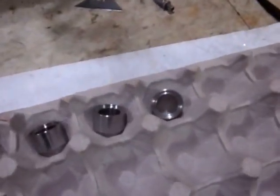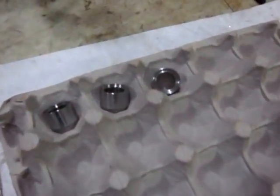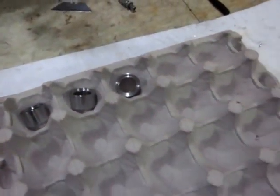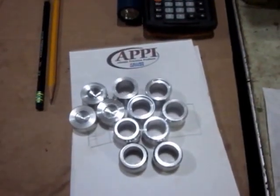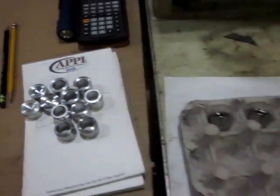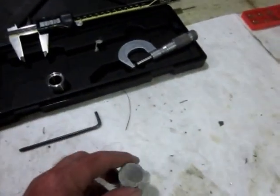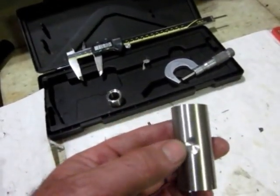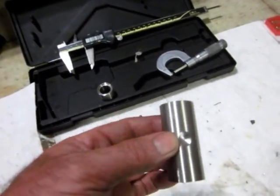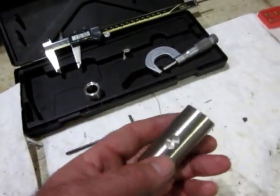I've had some success — I've made three pieces now without having to make any adjustments. Tolerances are plus or minus one thousandth on all the features. I did make a few out of aluminum and a couple more out of stainless to dial things in. I decided that if I held the stock in the middle I could cut my wasted stock in half — basically I make one and then flip it over and make another one.